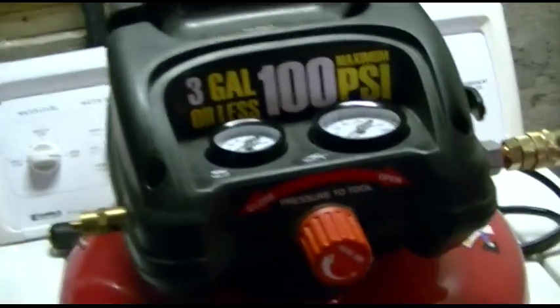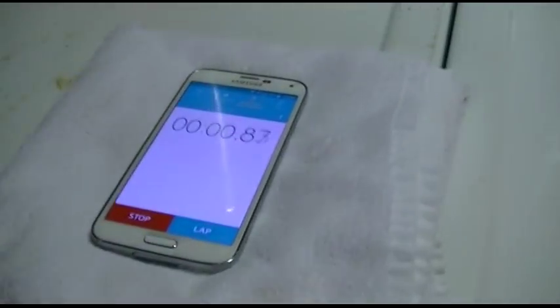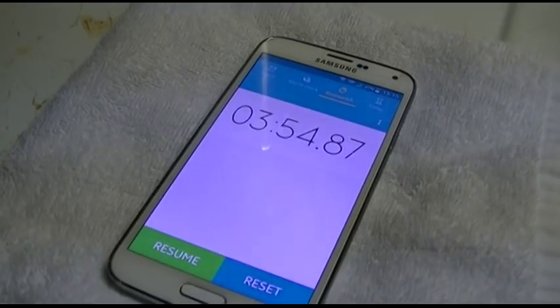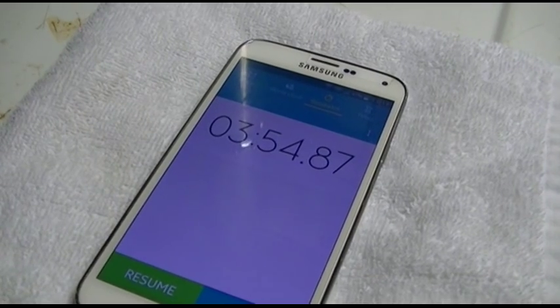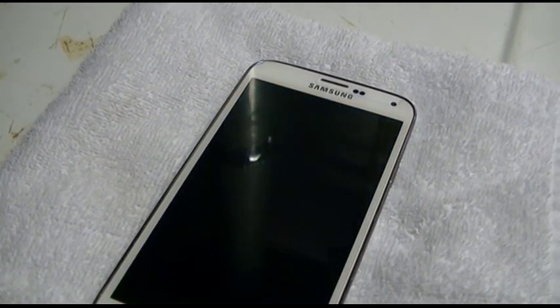Cover's reinstalled, head bolts have been tightened down. We shaved a good five seconds off of that — not a tremendous amount — but if yours has been taking a lot longer than four minutes to fill up, then most likely this will have a much larger impact on the amount of time it takes for the compressor to recharge.